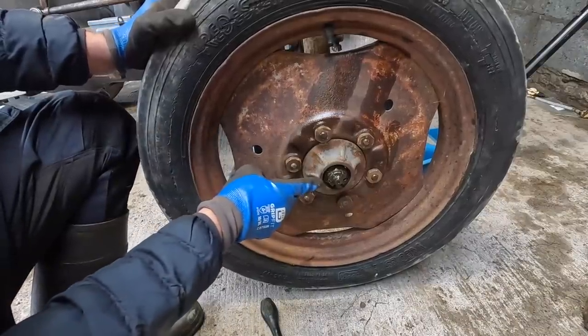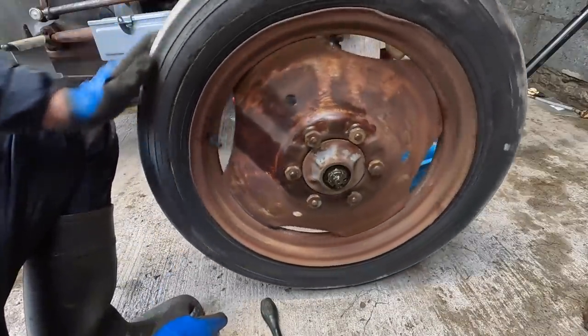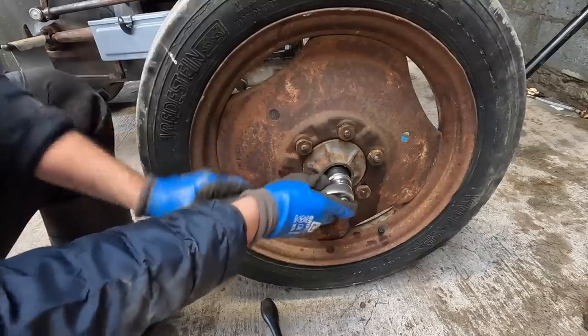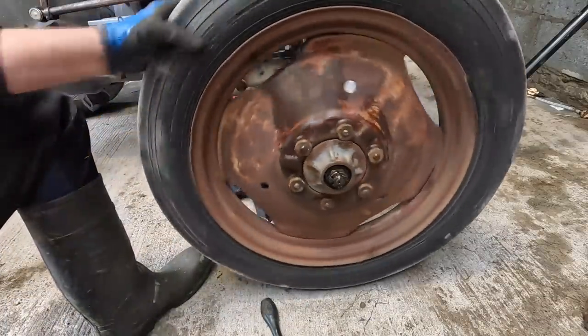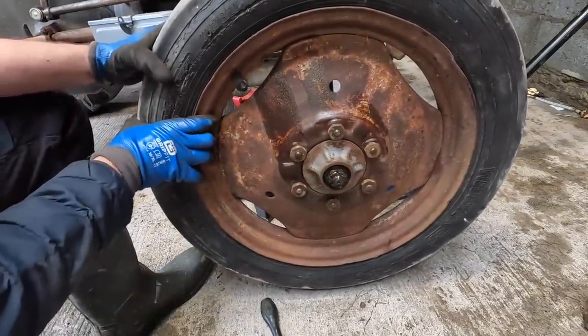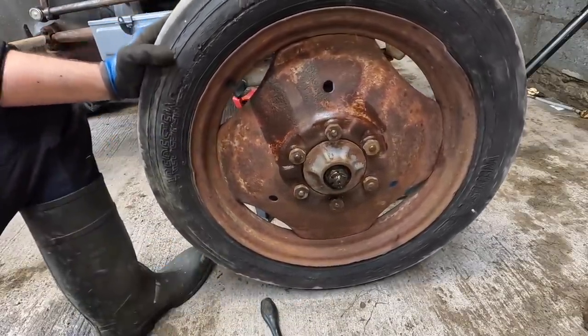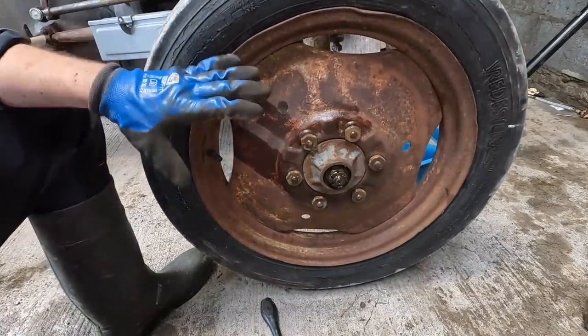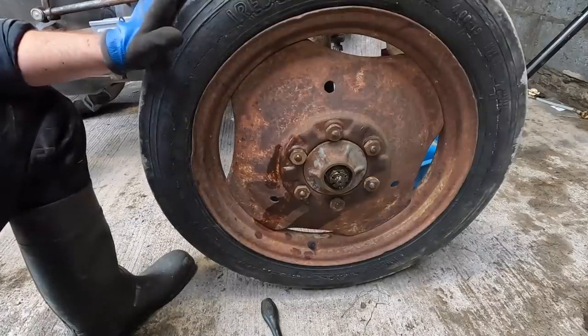There's a little bit of play - you see that play? Yeah, it's definitely there. We'll stick a socket on it and see what it does. That needs no bearing - that's tight. That just needs to be tightened, that's all there was wrong there. That doesn't need to come off - that's a good result. If you don't need to replace it, don't touch it. I have the bearing kit there if I ever need to put a bearing in, but for the amount of work this little tractor will be doing, I have a feeling that's going to be 100% okay.